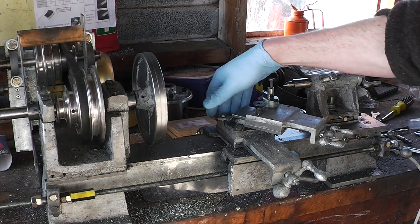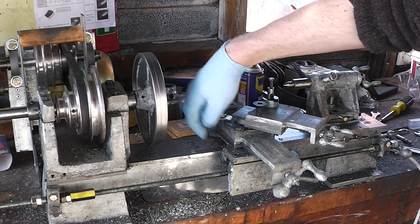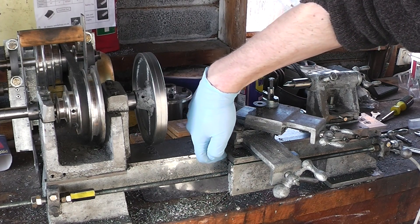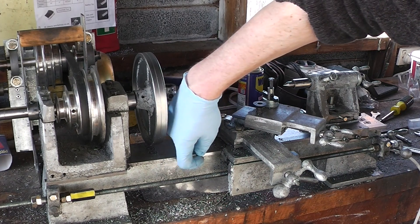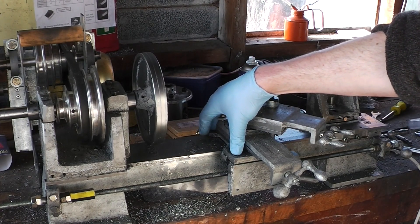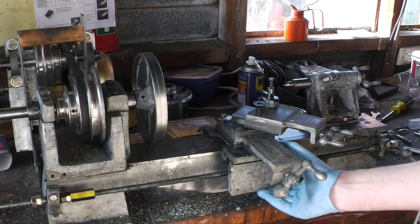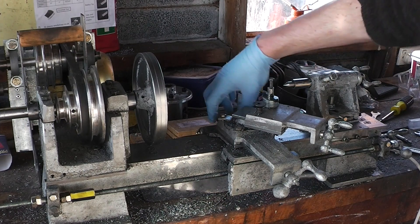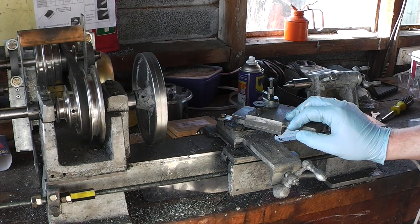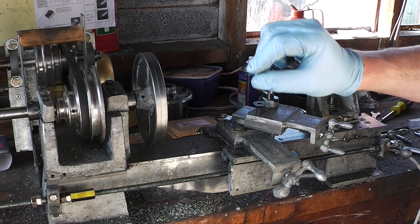The carriage is also where you will first learn the joys of shims — shims going between the casting and the clamp that's holding the casting onto the ways, making it so that there's exactly enough space to slide up and down on the ways. These were the first shims I ever did, and I honestly think I have to go back through them and reshim it, because I think that's part of where the flex I'm getting is coming from. There's very little missing, but I think it's just enough that when the machine is turning it's got enough torque that that little bit of shim wrongness is enough to cause problems.